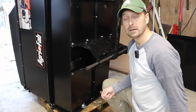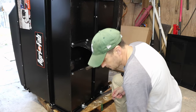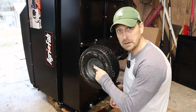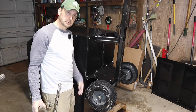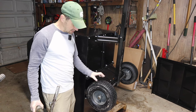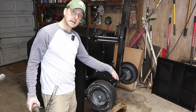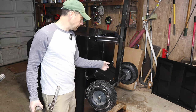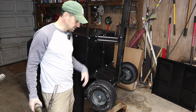Now let's get the wheels on — it's pretty easy. You're going to put in the spacer, a one-inch washer, your wheel assembly, another one-inch washer on the outside, and then a cotter pin. The cotter pin goes in the end and just bend it up. Before you roll this anywhere, you want to grease these. The hub comes with a grease fitting, so fill it full of grease until it's squirting out the sides. Where the axle goes through the wheel support, grease wherever it contacts the metal. It's probably going to squeak over time, but just continually grease it and it should be good.